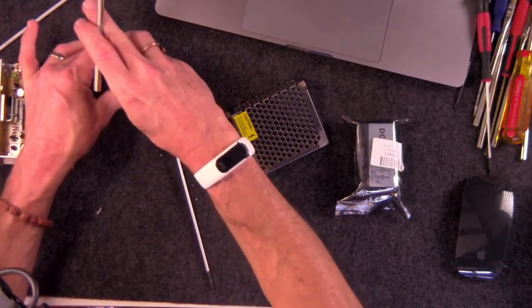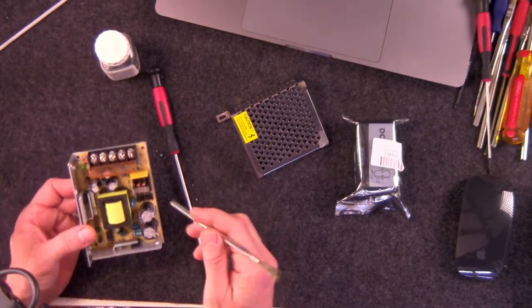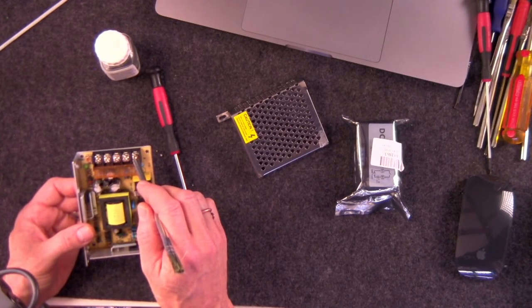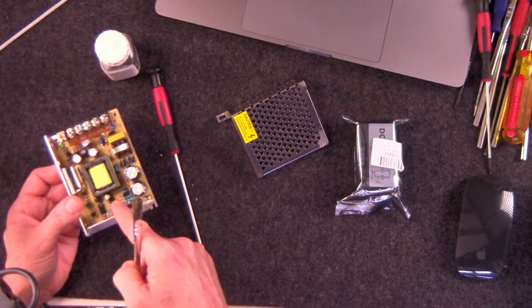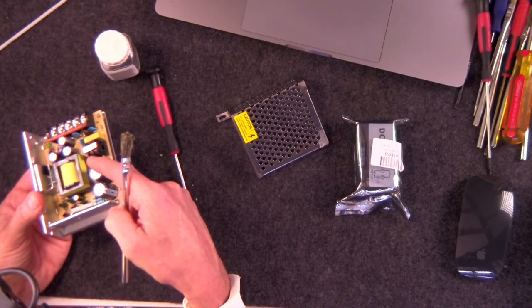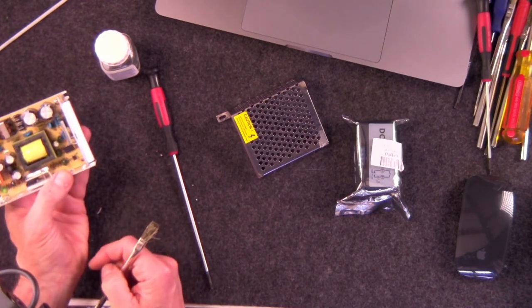Remember, though, at the same time that you're going around the whole board, and I tell you to be generous and thorough, avoid anything where there's going to be an electrical contact, and avoid anything that needs to turn later in order to be adjusted, anything like that. Everything else you can cover, including, by the way, any of these wire packs, any of these windings, just go ahead, dab it on there. There's nothing wrong with that. Go ahead and waterproof the hell out of that.